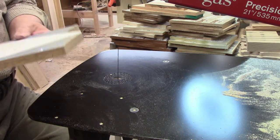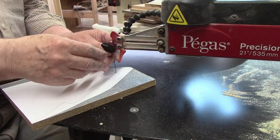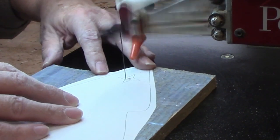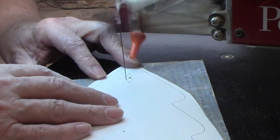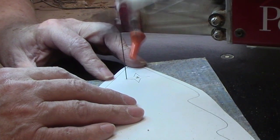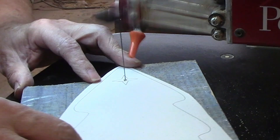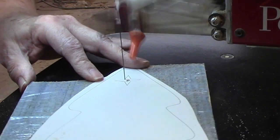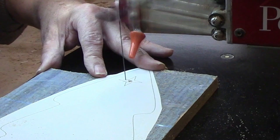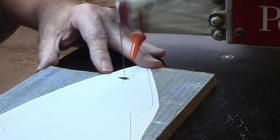This project would be cut from four layers of half-inch thick red oak. Over thousands of hours of cutting on scroll saws, I've developed a rule of thumb for deciding what size scroll saw blade to use on any project. The main factors are the thickness of the wood, the hardness of the wood, and the complexity of the pattern. Those led me to choose a number five Pegas modified geometry blade for this four layer scene. If you would like more information on that subject, I'll leave a link to my video covering it in depth on the screen and in the description.